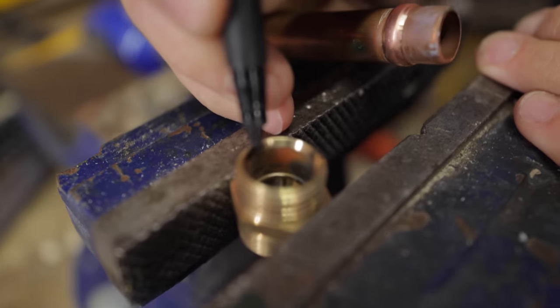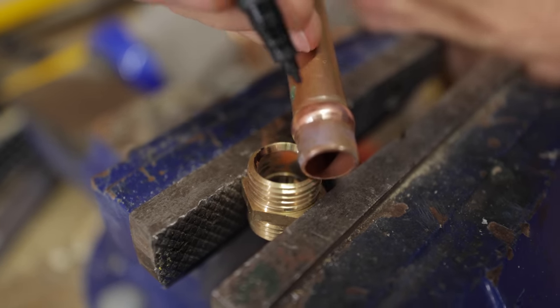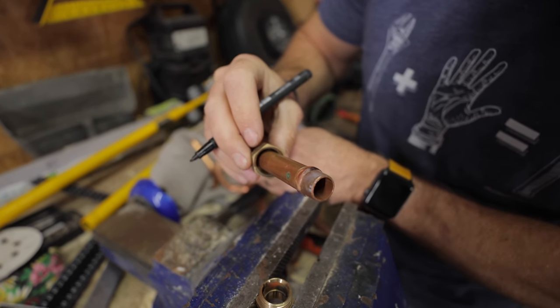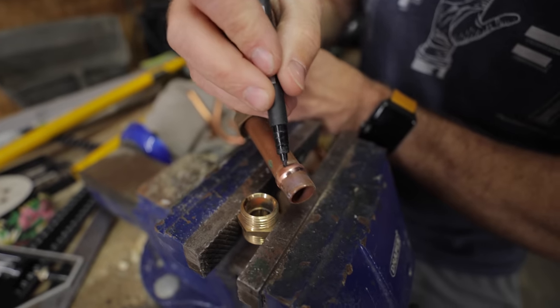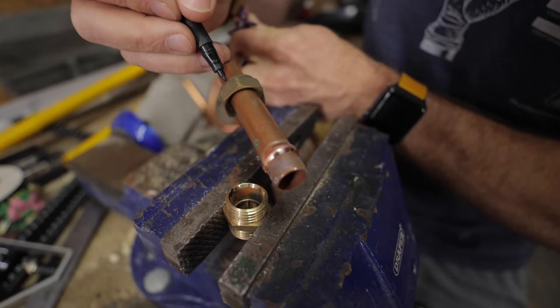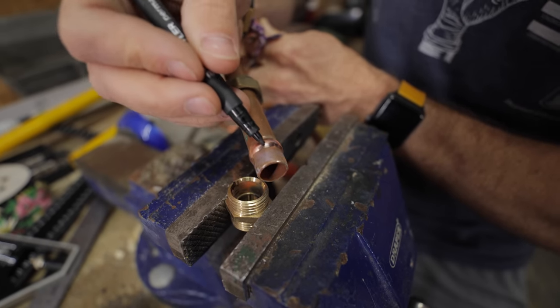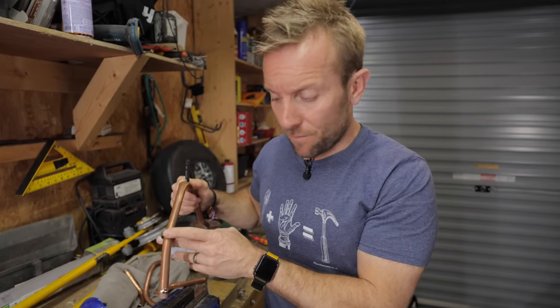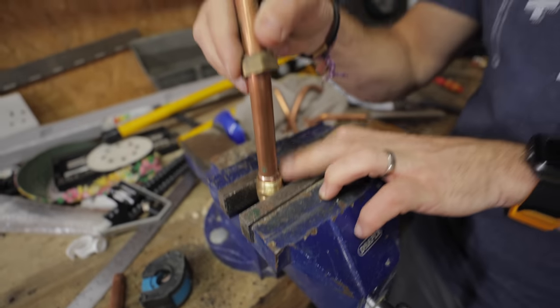What we mean by a taper is that angled piece. That taper meets the underside of our olive. And on the underside of our nut, we've got an exact same taper inside that meets the olive. So when we tighten these two up, the taper on both ends acts on the olive to create a watertight seal. They do generally work quite well, but it would be a mistake to not give this the best chance to seal nicely by not using jointing compound. Without jointing compound, they'll tend to squeak, and if they squeak, they're a lot more likely to leak.